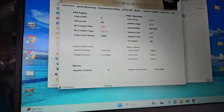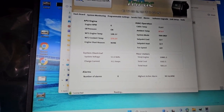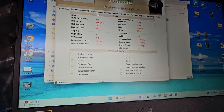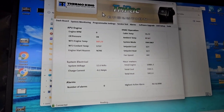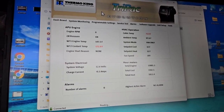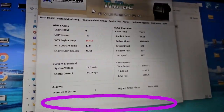What I did was I hooked my little cord from the APU controller, downloaded this program — I'll put it down in the link below — and it's supposed to tell me what the heck all of this means and why it's screwing up. It has different selections here. If you hook this diagnostics panel up and you get 'controller not ready' on your screen, it's because you need to turn on the APU system. Make sure you have it switched on both from the box outside and also the panel on the inside. You can see down there it says 'reading.'